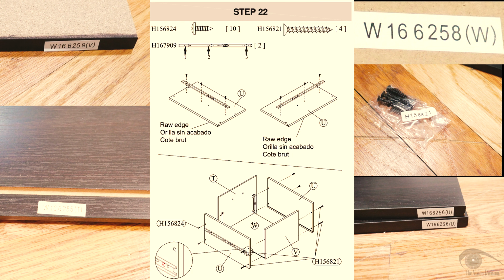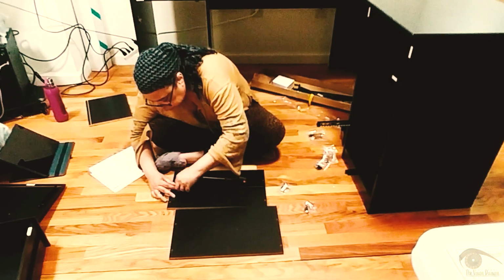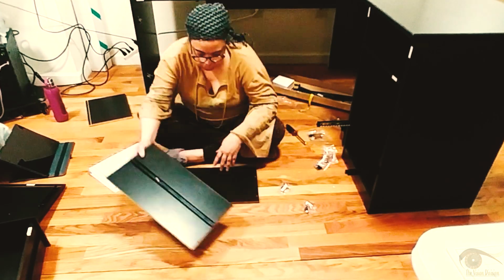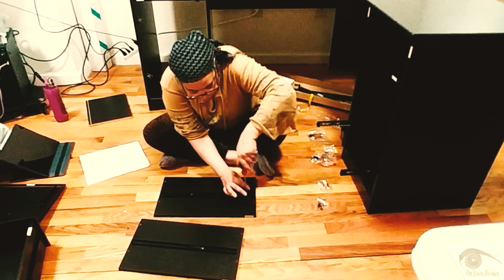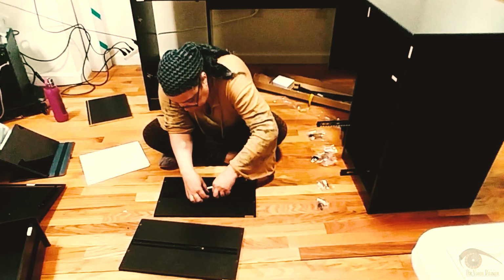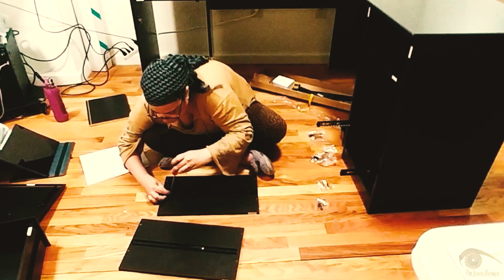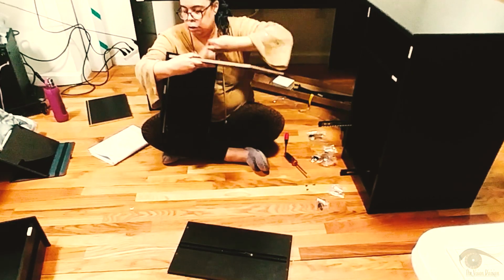To make the second drawer, place the second half of the sliders that you separated earlier, the parts with the levers, on the 2 U boards on the finished side of the boards. We're going to be using 3 6 by ½ inch screws in each board. Next, attach them to the T board the same way we did the other drawer.